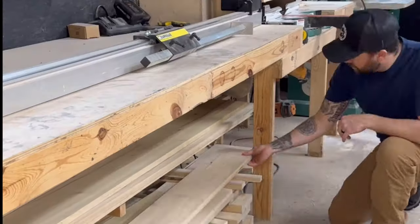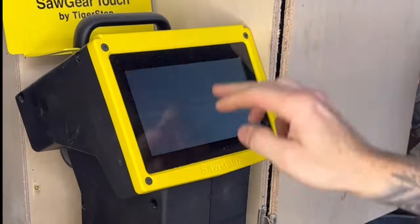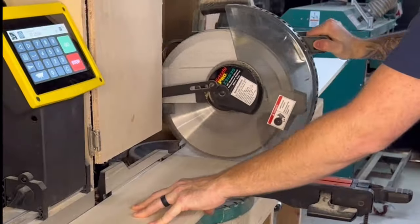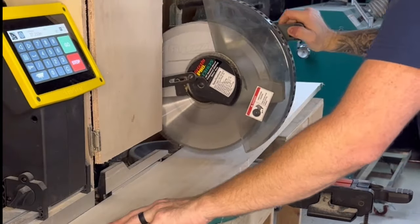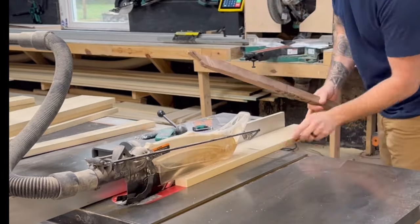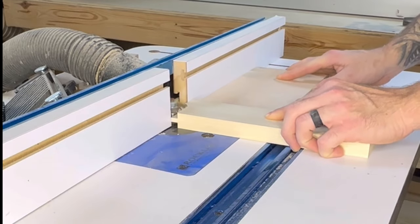14 by 27 1/4. To construct our cabinet doors, I'm gonna be using poplar for our rails and stiles. Poplar is a great wood, especially if you're painting your project. It takes paint very well and sands nice and smooth. I typically go with a width of 2.5 inches for the rails and stiles.